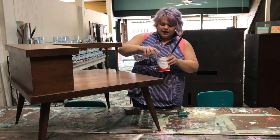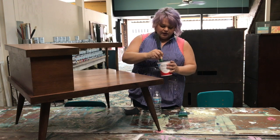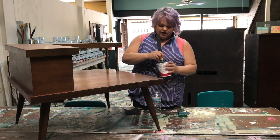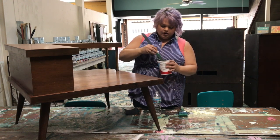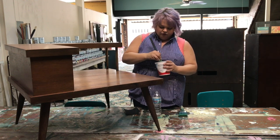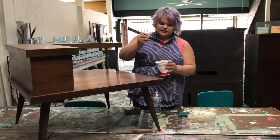I have my red paint and I'm going to add maybe 10 percent water in there and stir it together. The smoother or thinner you can make the paint, the smoother your finish goes, but it also takes the coverage down on your paint. So it's not a finish I do often because I love how good Annie Sloan paint covers on its own. I don't want to diminish that, but it really is how you get the best smooth finish. I've now mixed enough water in that it kind of looks more like regular latex paint.